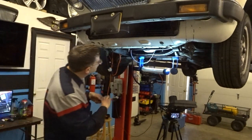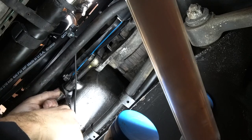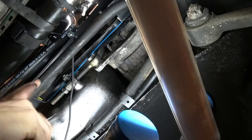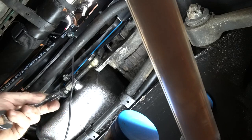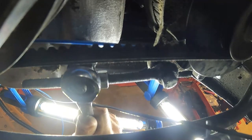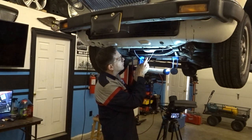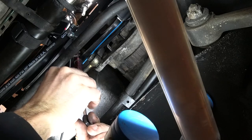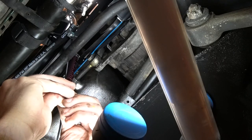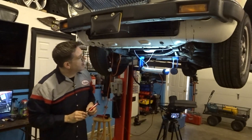Now that we're comfortable with the tension, we can go ahead and lock this up. We'll lock both nuts in place and then tighten our trunnion. Let's take one more measurement to make sure nothing went too far out of whack. We reset our O-ring, still have our plane reference, put it right in the center, test to about there — and yeah, we're still looking pretty good. That one is tensioned correctly.